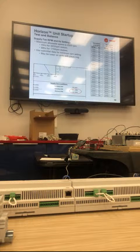I think, as in on the outside, like the ETL label? Yeah, it's on the build tag of the unit. When we started going to the plenum fans, now the 60 hertz isn't irrelevant. We're worried about the air balancer making air balance, so we're going to take that fan up to 65, 68 hertz. Yep. They actually have a test piece of paper with all their data on the motor and their fan curve, RPMs and everything, and they take that to all the motors.